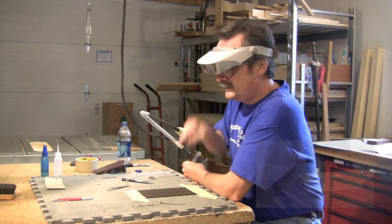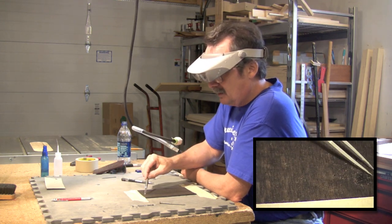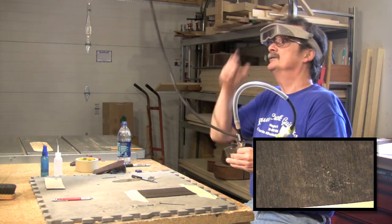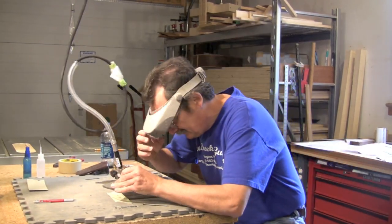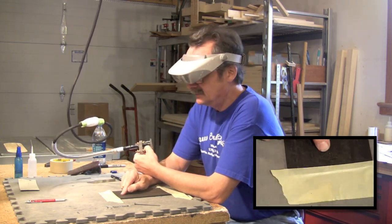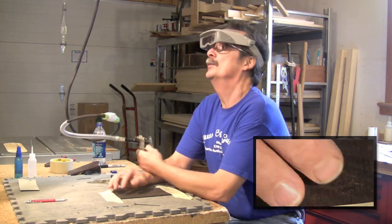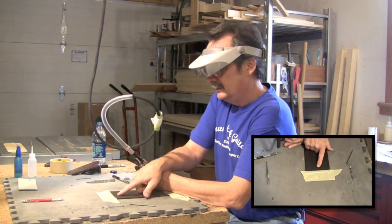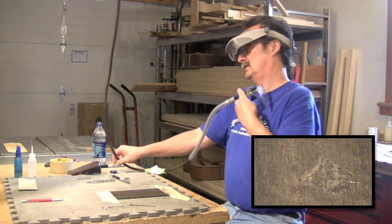All my points are now marked. I'll start up here at this little dot, line out here, line out here, and then I'll clean the field. The object is to go to the pencil line at this point. You can see how quickly I made my profile — I'm not quite at the line, I'm close to it. Now I'm just going to color out the field and open it up. You can see how quickly you can remove the material. Now I'm going to go to the line and check for fit to see how close I am.